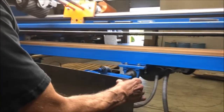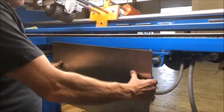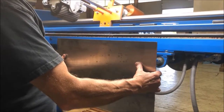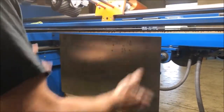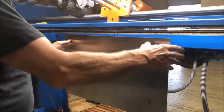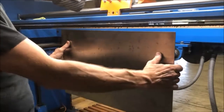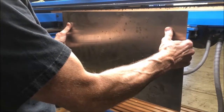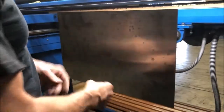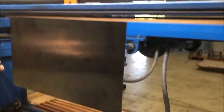Now you can bring this up. You need to angle it a little bit so that it sits high enough. You don't have to get it perfectly parallel to the belt — it's good to grind a little bit more open on one side. You also have the brake in the back where you can make infinitely small adjustments to make it parallel. So now you can basically grind this side. Up here is where you turn the belt on, and you control your belt speed from slow to very fast with this switch.